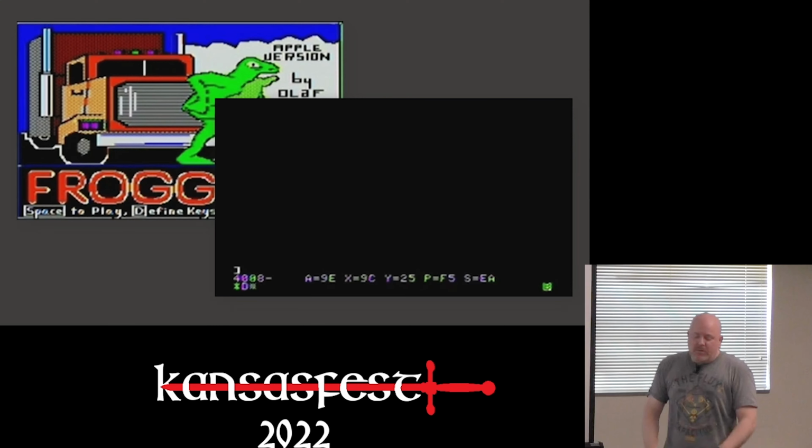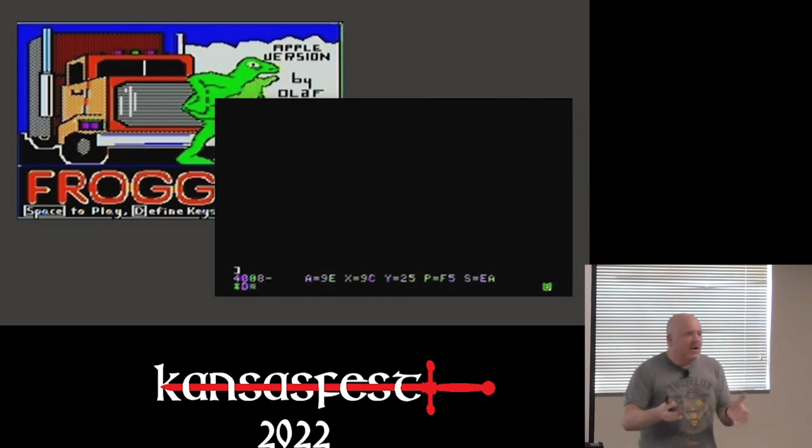Okay, so I don't actually have a ton to talk about on Rev 2 because it came up with just your typical hardware debug stuff. Except every once in a while, we would get these random crashes. They were repeatable, but they weren't always happening, though they were pretty consistent. For example, if BitsyBye was loading, it might crash during ProDOS, but it would always crash when it tried to access slot 3. AppleWorks would crash right before it asked you for the date.